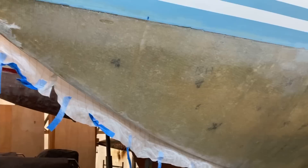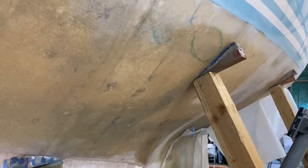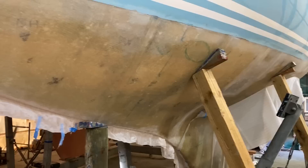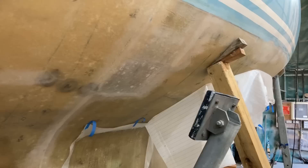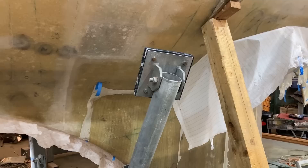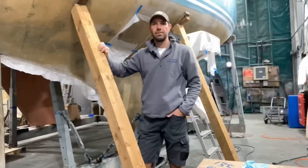I'm going to go over the entire hull with the sander just to knock off any high spots — I can feel a slight high spot there even with my fingers. The reason I take so much effort to keep it flat is it makes the filling and fairing process so much quicker. Throughout this whole process — peeling, sanding after peeling, media blasting, and laying up the glass — I've been trying to keep the surface reasonably flat and fair. If I hadn't done that, the process of filling and fairing would take so much longer.